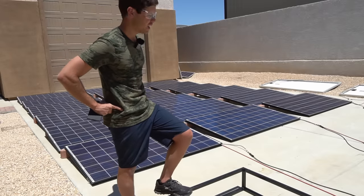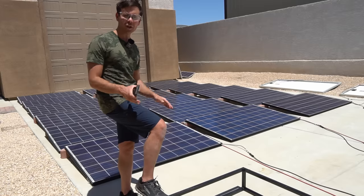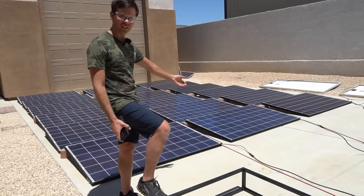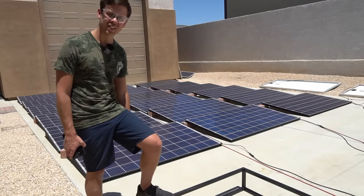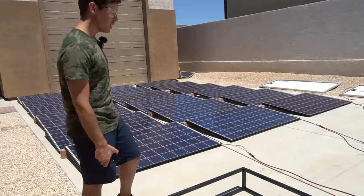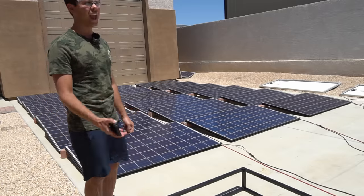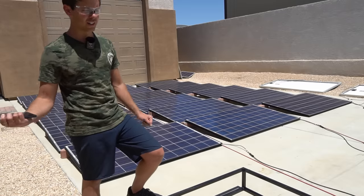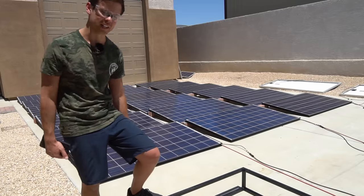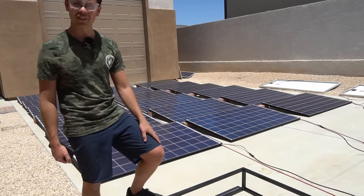These are super cool panels and they'll have a ton of them for years, so no need to worry about them going out of stock. We built this array for under $1,000 in less than an hour. Consider the cost savings of ground mounting — I know it's not recommended, but for the price the output is great. If you wanted this many panels on a house you'd spend about $16,000 plus interest on a 20-year loan. Instead, just throw these on the ground, power your electric car or air conditioner, and reduce your electricity bill without needing a permit. You can even use an automatic transfer switch so that when battery voltage gets too low it switches back to grid power at night. Super cheap solar array — pretty impressive results.